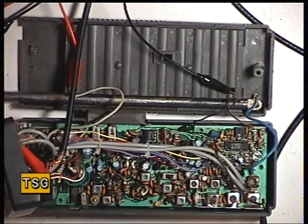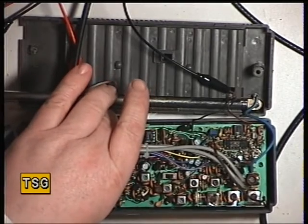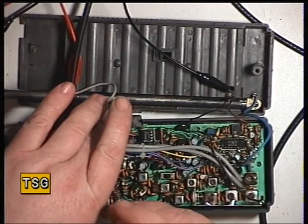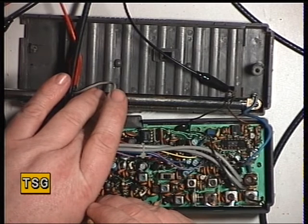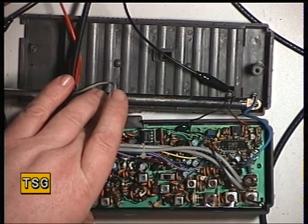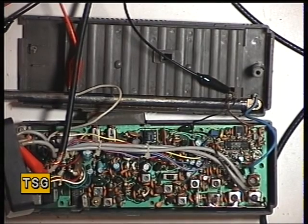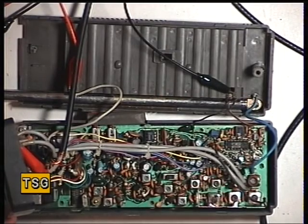Right, move on to getting the frequency spot on. Should be 27.79125. It's 27.79221. As I've said many times before, these drop naturally with age, which tells us it's been fiddled with. 7912. Come on. 129, that'll do nicely. They also have a high-low power setting, and it's through the battery case at the back, which is kind of really silly.